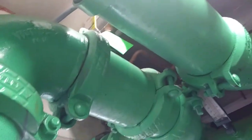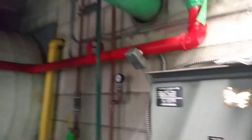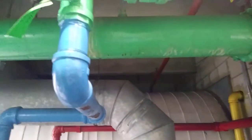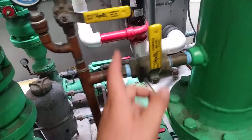Unions on both sides — some people think that's excessive, but I like having maximum serviceability. If you have to replace that valve, I want it as easy as possible. In my situation, a lot of times I'm the guy who's going to be working on it later, so I always set it up that way. The boiler's valved off at the moment because we're in the middle of summer — this building barely needs it in the winter anyway; we're in Southern California.